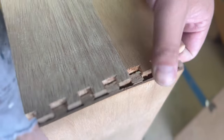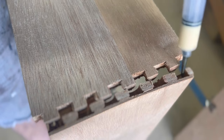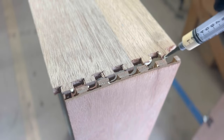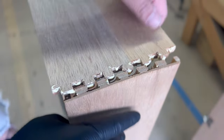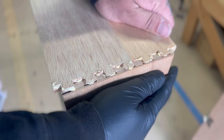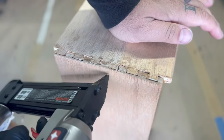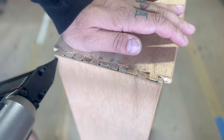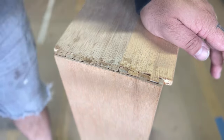During the process of taking all the drawers and hardware out is where I like to check for any structural damage. On this piece there were a few drawers where the dovetails worked their way loose — all the glue dried up and it's not holding anymore, so I apply some new glue. I'm using Titebond 2, which drives pretty quick, and because I don't have clamps long enough I'm using a pin nailer to secure them. It's better than just glue alone.